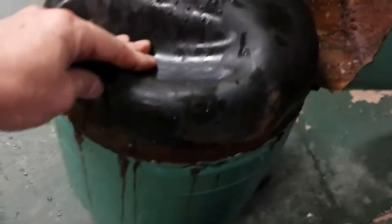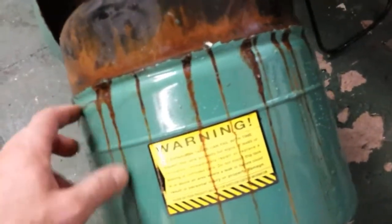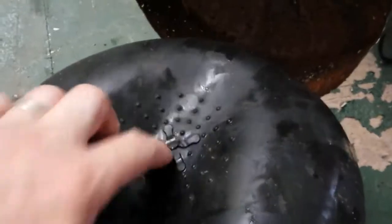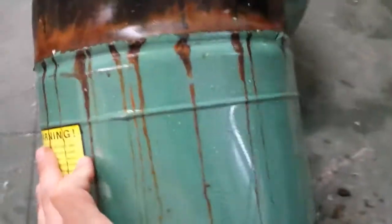Anybody that wanted to see the inside of a bladder tank — here you go. Just a big balloon. That side's all full of air. This thing doesn't actually go all the way — it's not just a solid balloon all the way around. It goes in, and it seals in here. So it's metal on the bottom side and rubber on this side. You got your water coming through here, and as it pushes and comes back, that's what helps keep your pressure up. It looks like this thing's been leaking for a while and apparently nobody noticed it, and then she blew her top.